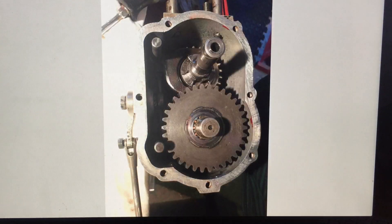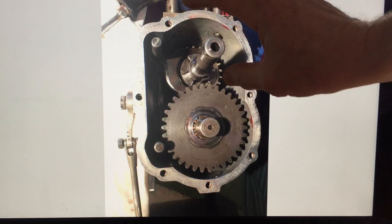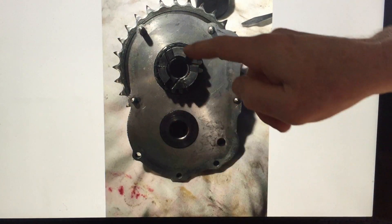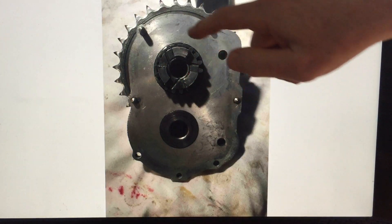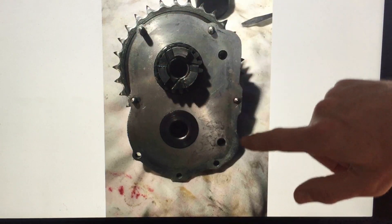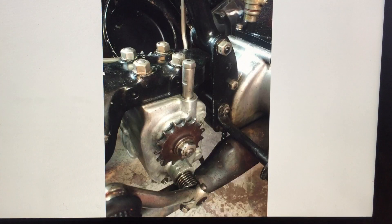This is the mating part — the last gear, which fits into a bearing. On the other side is another gear that meshes into this one but also acts as a dog that fits into it. There's the bearing for the lower shaft and the dog that meshes into the top part, with a gear on the outside of it. I did cut the angles into the dogs on this part as well. It's not as much of a problem here — this digs quite nicely into the other dog. Make sure you clean up the sealing face with no dents or dings around the outside, especially if you're going for oil lubrication. Then it's just bolted up with a bunch of bolts on the side.